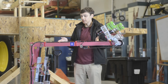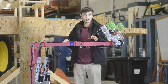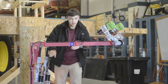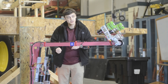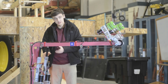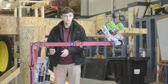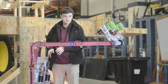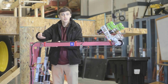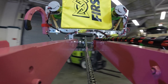The control system on this robot has to be very precise. We built it with very tight tolerances to stay within the frame perimeter at all times and accurately sense where this arm is at any given time. We have these two dart actuators, both with a potentiometer that allows us to get absolute positioning on their movement. You can translate that into inches of movement and work out the rest with basic trig. We're running PID control straight on the Talons in units of the potentiometer's rotation.